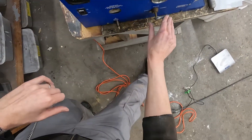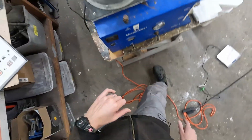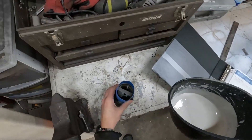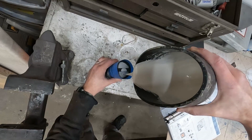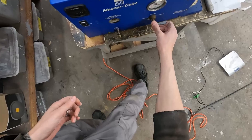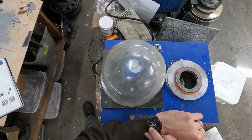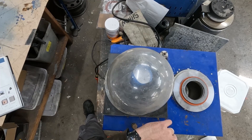Switch it off and release the pressure by putting the arrow straight up to the release. It comes loose. Pour it right into our flask — half an inch or so above the top of our model. Put it back in the vacuum chamber, turn it back to invest, flip it on. Now we're going to do 90 seconds total.